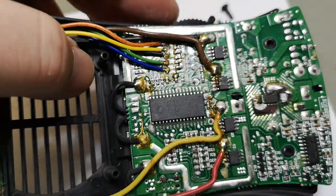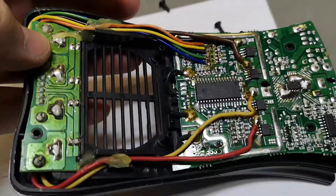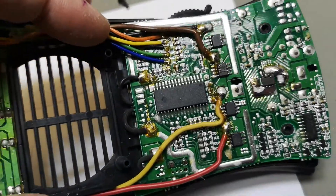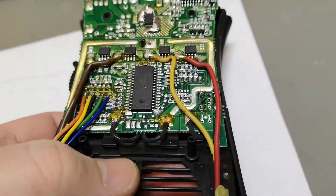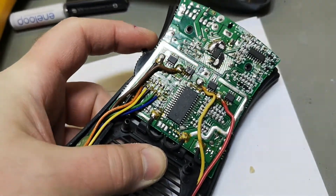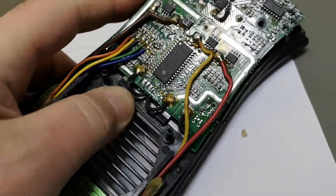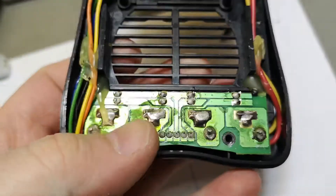So this microcontroller is for measuring each of the cells' different voltages. Look at those different wires - those are the return wires individual to each cell, and the positive to each cell. Wow, it's really complicated - I didn't expect it to be. And those are the flexible positive connections.